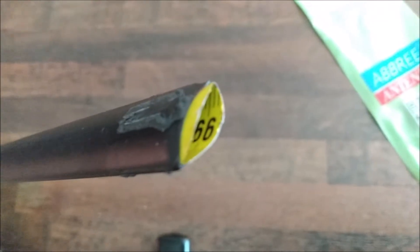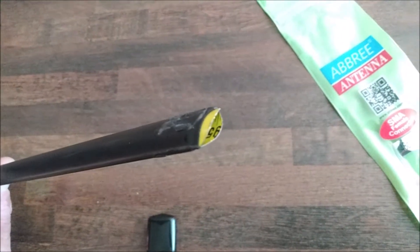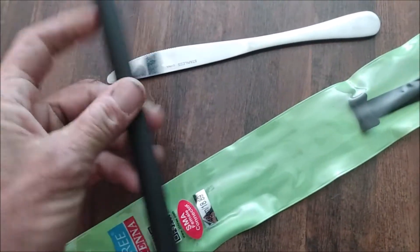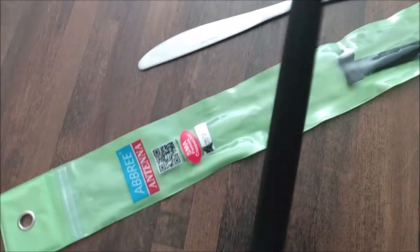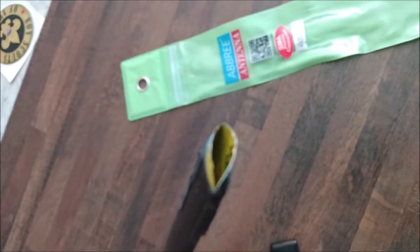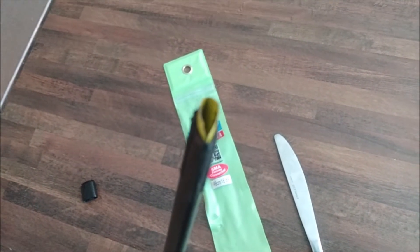It's quite interesting — it's a tape measure. What a great idea! A tape measure folded over in half and bolted to the adapter at the bottom. That's what makes it flexible — just two opposed pieces of tape measure folded in half at its center. Whatever length corresponds to the bandwidth you want, you cut it off.